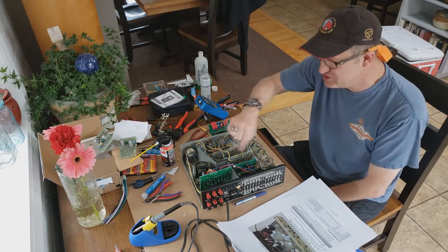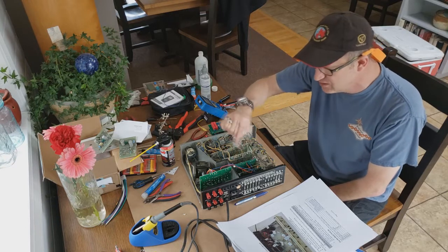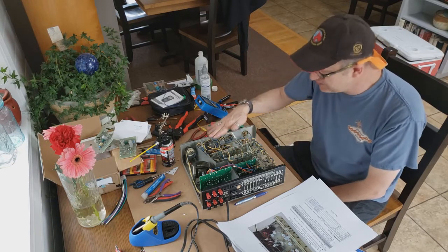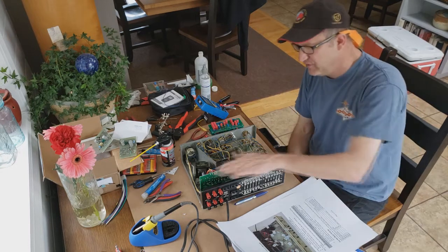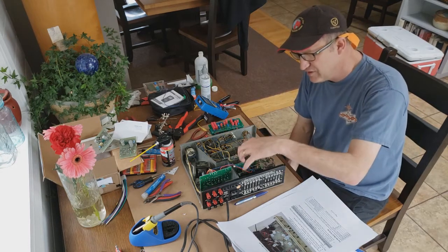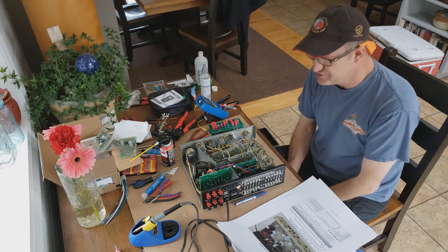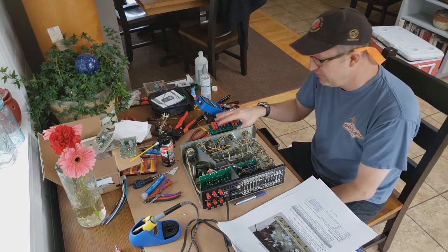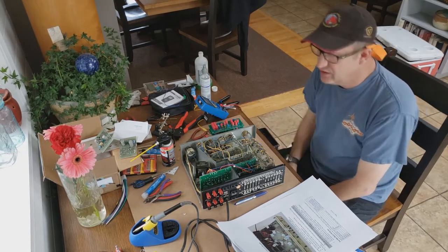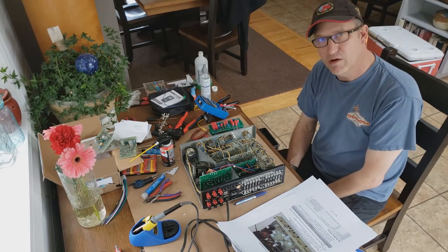I did voltage measurements and everything. So, the power supply is delivering plus and minus 15 volts here. And grounding to chassis is working. So, I think everything up to this point, hoping that the phono boards are wired correctly, and I'm pretty sure they are. We can assemble these two, do the RCAs, and then go to a test. So, onward we press.